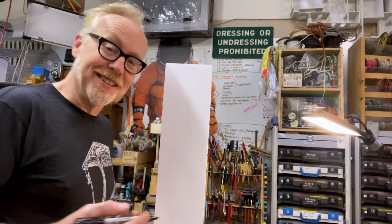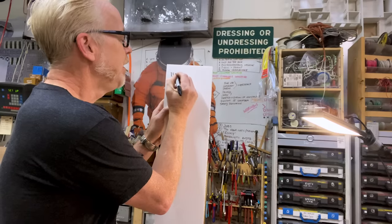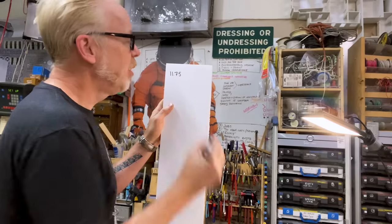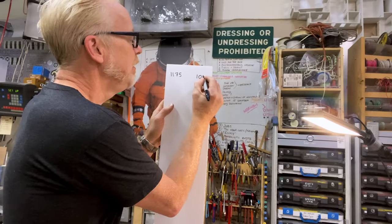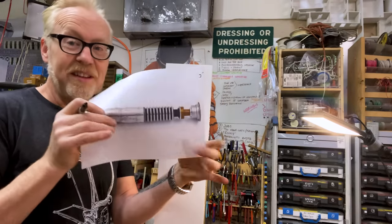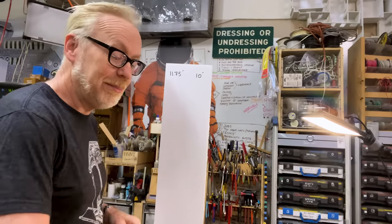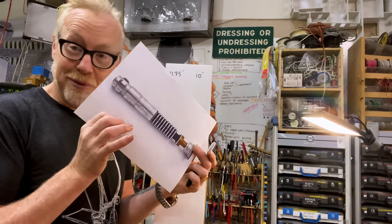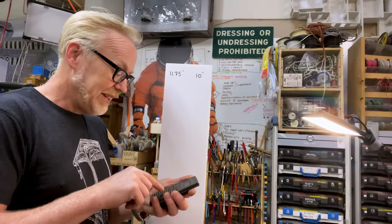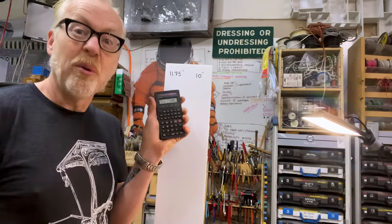We're gonna do a little math here on my channel. So the actual dimension is 11.75. And the dimension that we currently have is 10 inches. So we need to blow this up by a certain percentage. This is 10 inches long, and we need to blow it up by a certain percentage to get to 11.75. Well, this math is really easy. 11.75 divided by 10 equals 1.175.